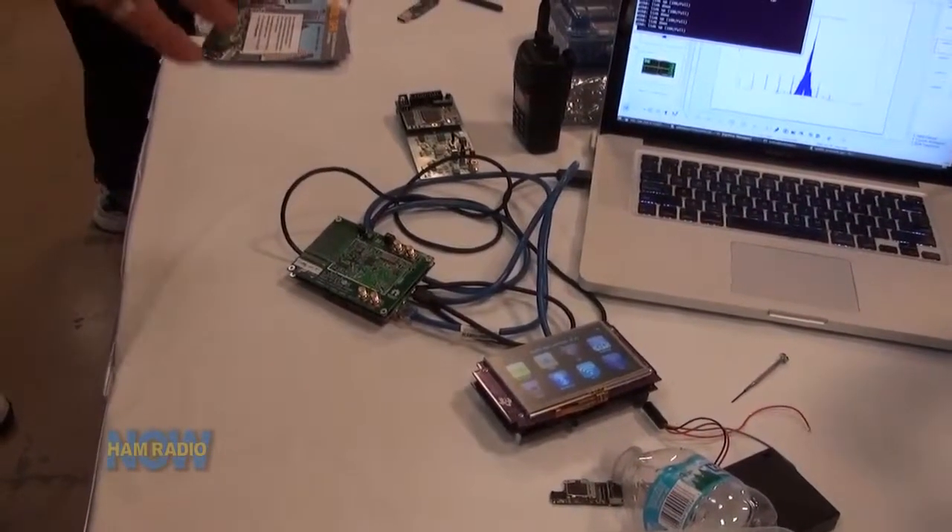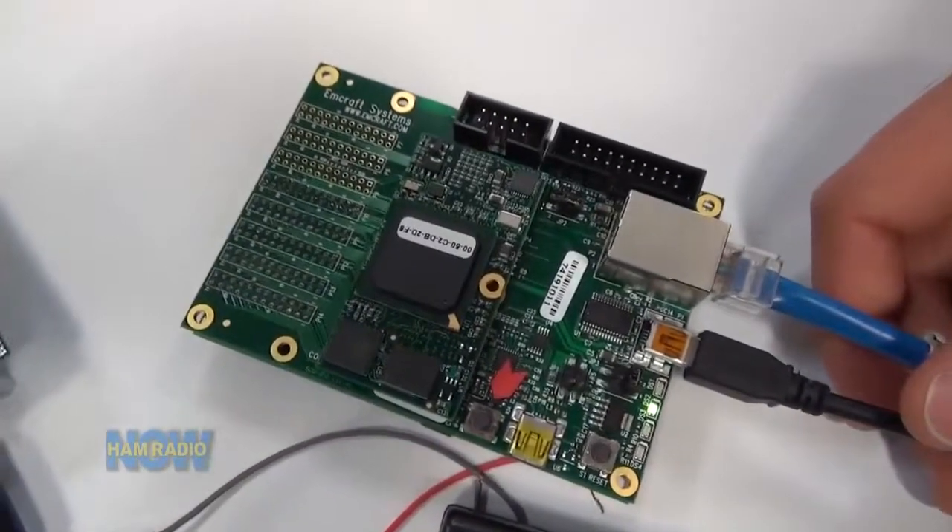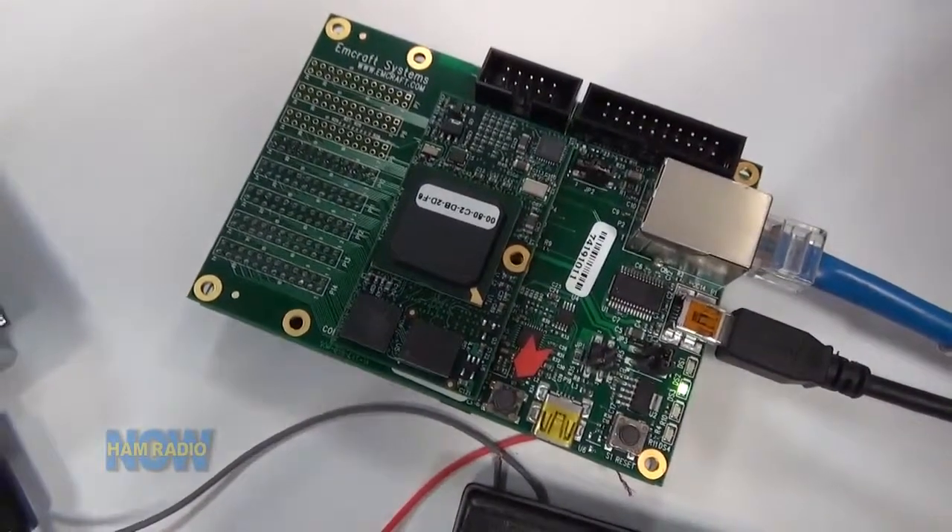What we are here to talk about is what you were describing to me on Google Hangout about a month or so ago — your new product. We're talking about the HT of the future's first component, which is Whitebox, which is essentially a radio modem. It has internal to it a microprocessor running Linux and a gate array. It is very low power because the gate array uses flash instead of SRAM. And it's got a whole radio, which Chris has designed all of this. Chris is doing the work on this one, but I'm a systems programmer and I do some programming for this.